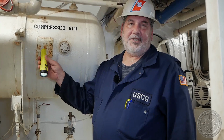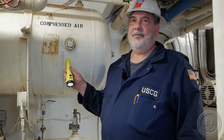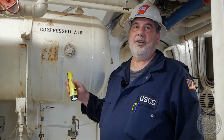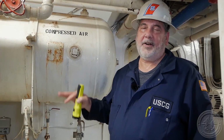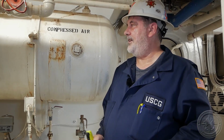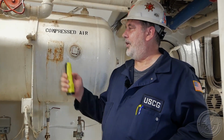And then the worst case scenario is we just don't have the data on the plate available to us at all. There is fabrication information contained on what's called the U1A sheet, and every ASME and or Coast Guard approved unfired pressure vessel had a U1A sheet originally when it was fabricated, and you can require the vessel representative to find and or provide you that sheet, which will have all the data that you would need to see on a marking plate.